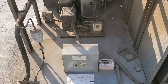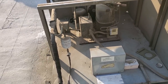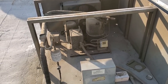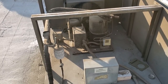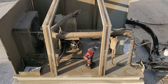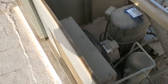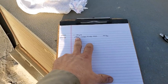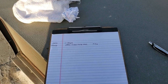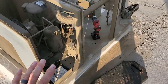I did confirm that the coil has 115-volt motors in it. Sometimes on walk-in coolers, you'll have a high voltage on the roof and then low voltage — like 115 volts — at the coil running the fan motors, usually two separate power sources. I've come up with the amp draws: the condenser fan motor should run at 1.1 amps and the compressor approximately 9.3 amps, but that will change as pressures in the system change.